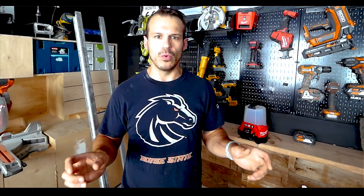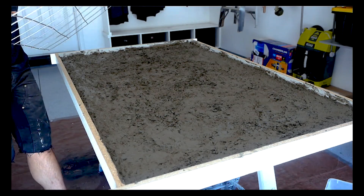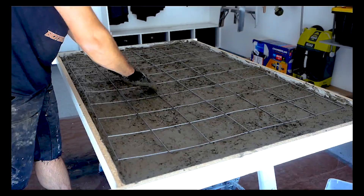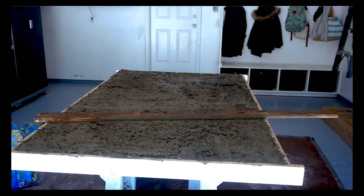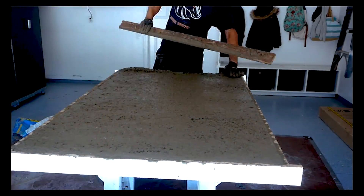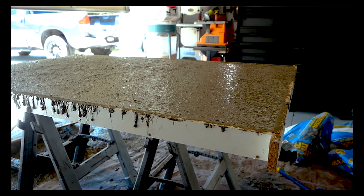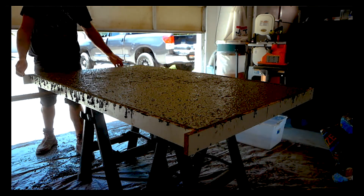Use shears to cut the wire grate. When you install it, make sure it covers the edges of your mold by at least an inch — the closer to the edges the better, but keep in mind the closer you get, the more chances you'll see the reinforcement. Once the first inch of concrete layer is laid down, bring your reinforcement, slap it on top, then fill in with the rest of the concrete pushing it into all the nooks, crannies, and sides. Take a long two-by-four or one-by-three, shimmy it from side to side like sawing, pushing high spots into low spots and adding more concrete to fill in low spots. Then focus on getting the air bubbles out by wobbling the form for a longer period of time.